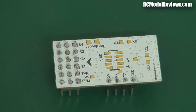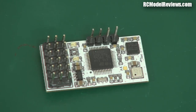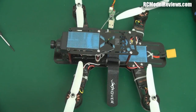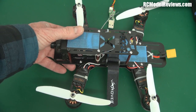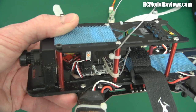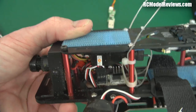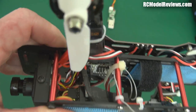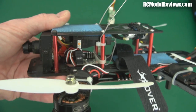If you're not good at soldering, you might not want to go for this. The Naze 32 also requires some soldering, though some vendors will solder pins in for you for a small fee. Once we've put all the pin headers in, the first step is to install it in your multirotor. I've got one installed in this MXP230 multirotor — you can see it sitting right inside there with the ESCs plugged in, a lead off to the receiver, and the computer connection pins accessible.